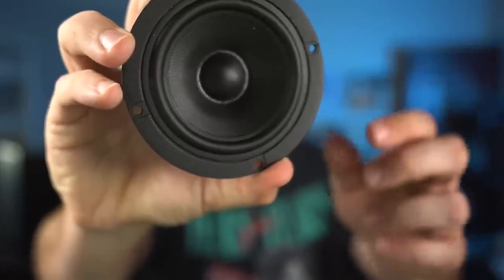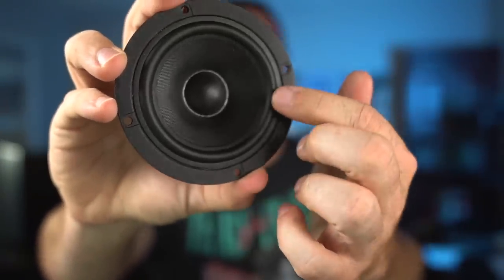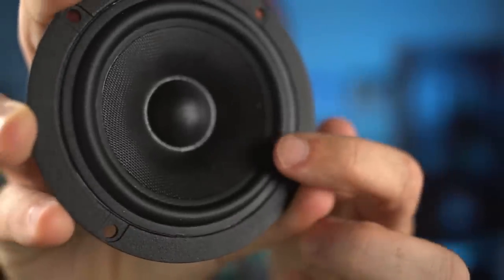What I have here is a little three and a half inch driver from ScanSpeak. The cone edge is where it connects to the surround. With an ideal speaker, in theory, you want that cone and surround to move together as one — the surround is there basically just to hold the cone in place. But what happens is there's a compliance issue where those two materials are moving almost out of phase with each other at a certain frequency — in this case around 1.2 kilohertz. When they do that, they create a resonance blip and we see a dip in the response. This also manifests in the distortion data, which I'll show in a moment.